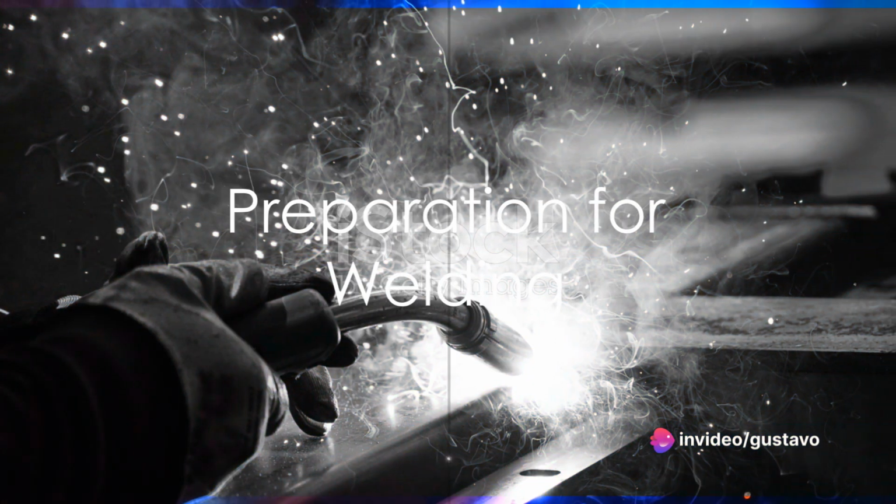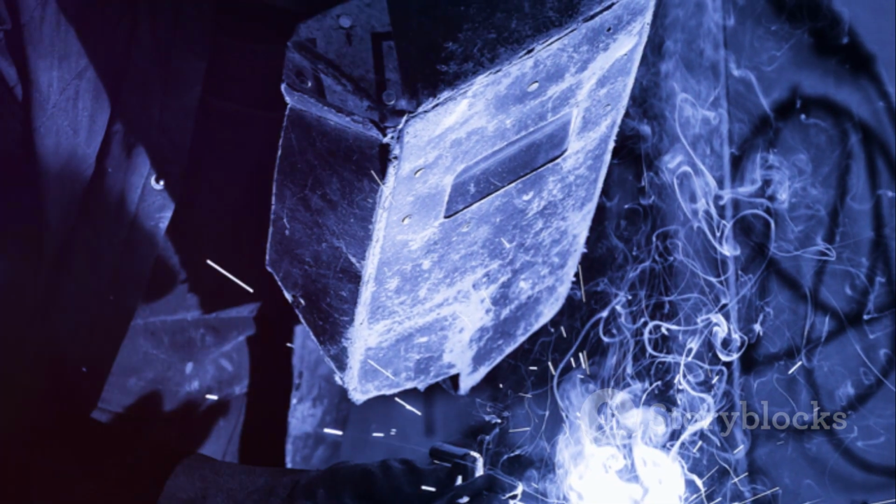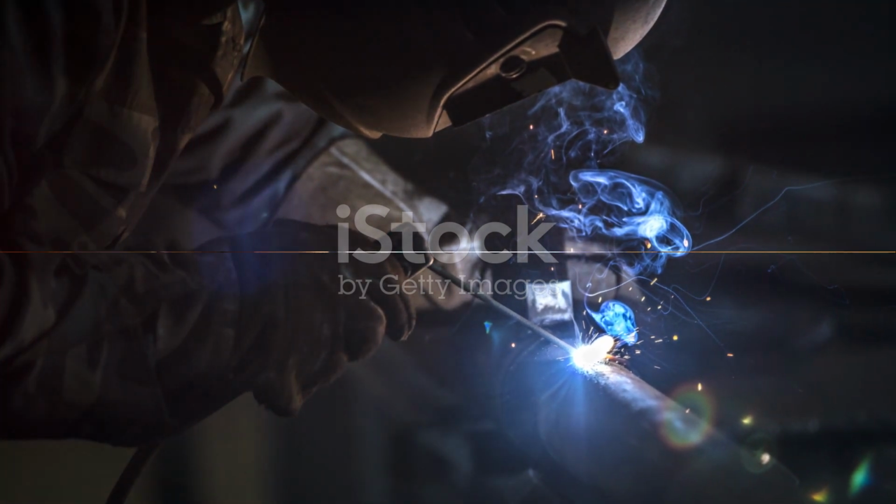Before welding, it's important to clean the surfaces to be welded and select the appropriate welding wire and gas based on the material and application. Different materials may require specific combinations.